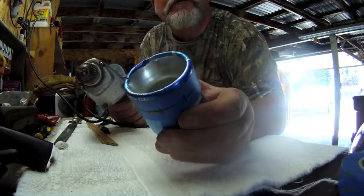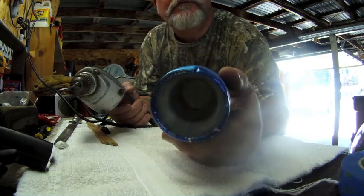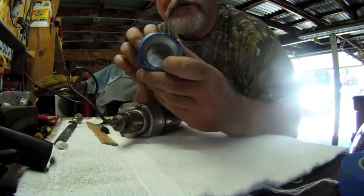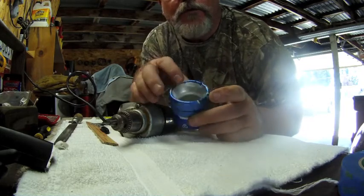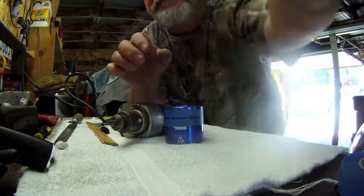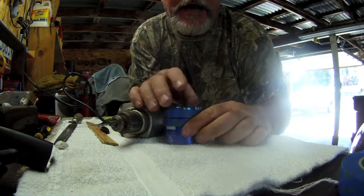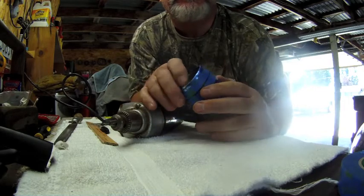There's one very, very important thing you need to remember when you're drilling your jets. Be careful and go slow, because you only want to drill holes through the outer wall. You don't want to let those jets run through to the inner funnel, because it'll ruin the stove. It won't work. Remember, we want the fuel to run through these vents inside between the funnel and the outer wall. And so what happens is that when you put fuel in here, you take your lighter and light it, it just kind of sits there and bubbles for a little while. It heats up the gas that you put in there, which I'm using heat, okay, in the yellow bottle. And once it starts to boil, the heat turns it to gas, and the gas gets caught right inside this outer wall, and it forces the flame and the gas out your jets.